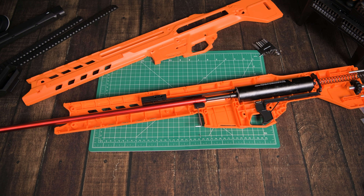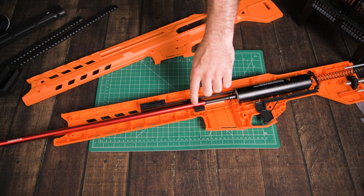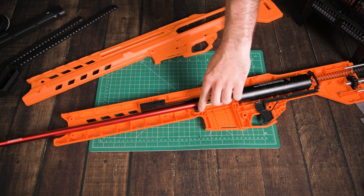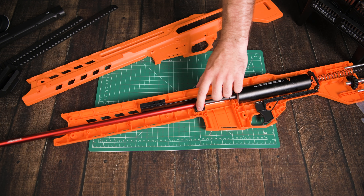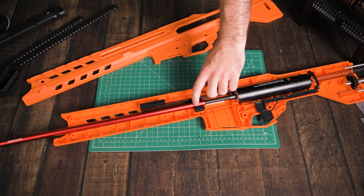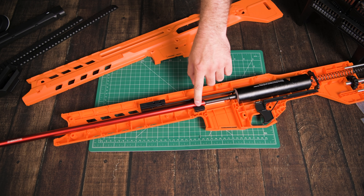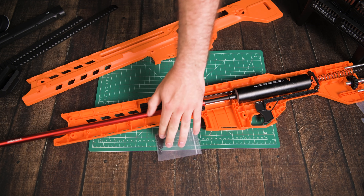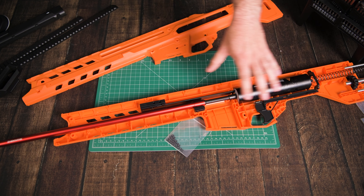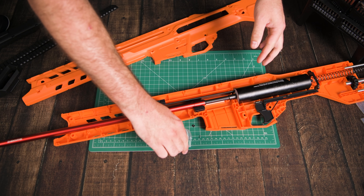We need a little block piece that holds the barrel in place. In this block there is a hole in the center — a grub screw will go into that, which is adjustable from the outside of the shell to remove or insert your barrel. So the grub screw clamps down onto the barrel. Once it's level with the plastic, simply sit it Allen key side down in this little spot. Once the shell is closed up, you can fasten or release your barrel by putting an Allen key in and turning it to loosen or tighten.